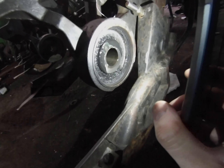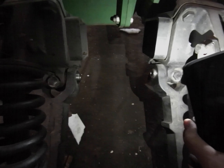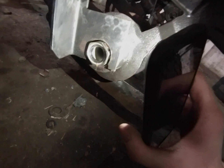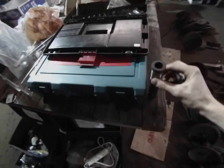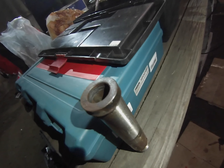Here you can see I'm putting the hubs back together. Here's the dirt that's getting into the cavity - not good. This one's really bad. We're replacing these main pins as well - pins and bushings. There are our spindles with the triple lip seals in them. So we're putting a triple lip seal on the spindles - that's a much better design than this one here, which is just an o-ring. Not a very good seal.